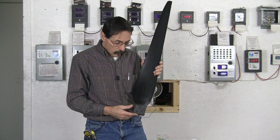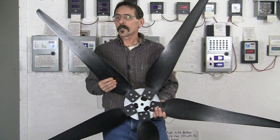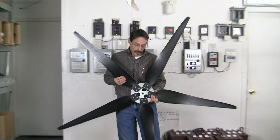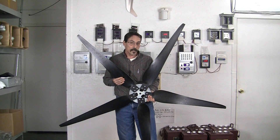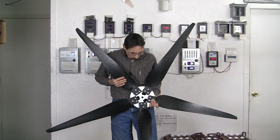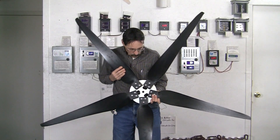So if you are not sure if it is going to fit, we will have the CAD. You can use these wind turbine blades on any wind turbine you like. A 17-millimeter hole fits all of our Freedom PMGs — Freedom 2 and the single Freedom — and it will fit any Delco with a 17-millimeter shaft.